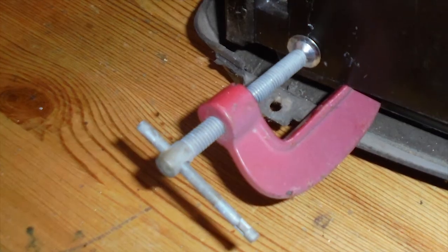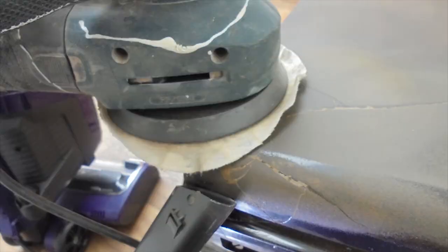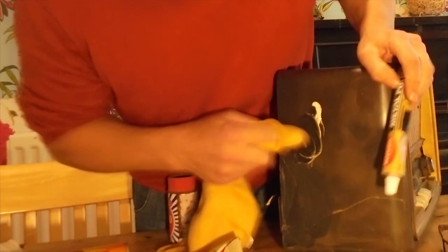And it was just basically working with your 5 minute deadline with the Araldite, holding it in one place or using tape or clamps or whatever to keep it flat, and doing it over 5 days so that you can wait for it to dry solid before you sand it down and build on it slowly until you get it all in one piece again.